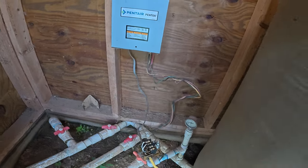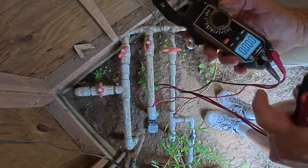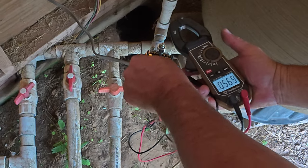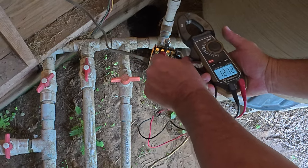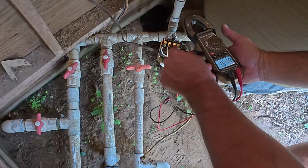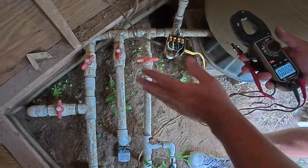Let's grab a meter and we're going to test the voltage on that. I'm going to put my meter on AC volts and then I'm going to jump across these two connections right here. I do not have any voltage. And if I jump across these two just to be on the safe side — zero voltage, zero voltage. So I have no voltage across any of this, so I'm good to start touching those.